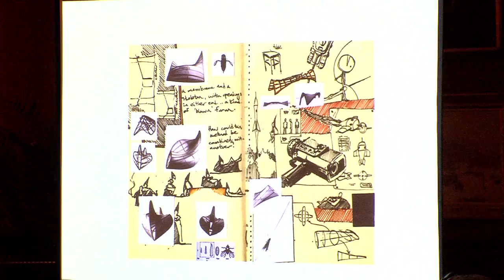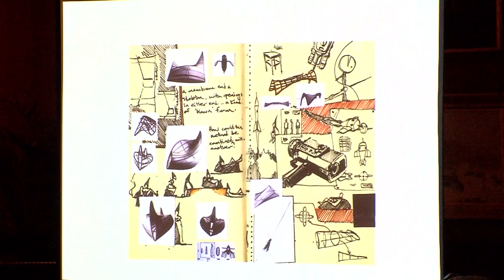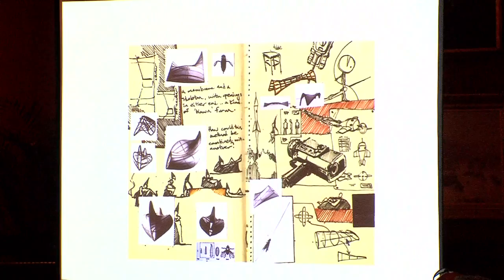But if you look down here on the bottom right-hand side of the sketchbook, you can see these ellipses. So here's an ellipse that's horizontal, and slightly getting fatter, a circle, and then going vertical, right? With those cross sections, let's say your mold sections, the lines that are traveling along them in this direction, those are the lofting lines. So those lines are translating those geometries to one another. So that's just a translation from a horizontal ellipse to a vertical ellipse. That's how simple it is.